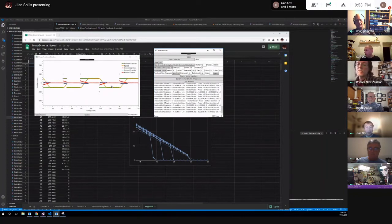The other problem you're going to have is that none of the wheels are actually right, because you're making an assumption that the wheel of interest would be placed where it would be if it was a differential robot. So you actually have offsets on the front and the back. So all four wheels, when you turn, are going to slip.